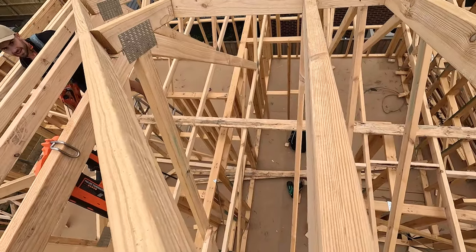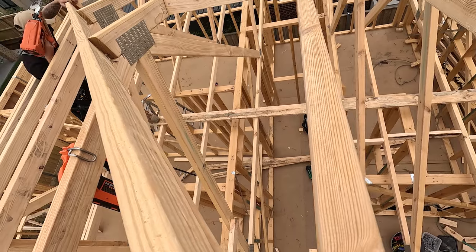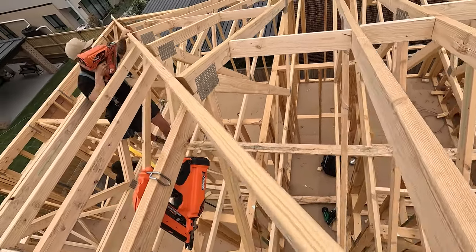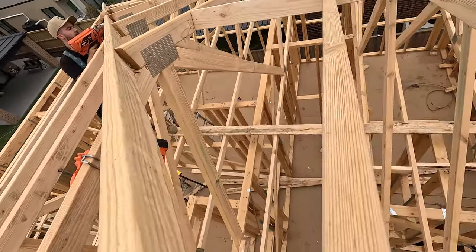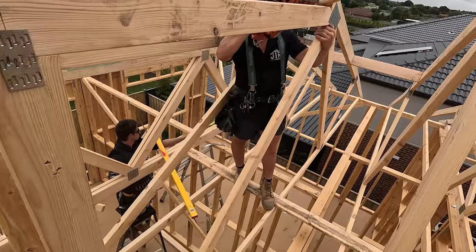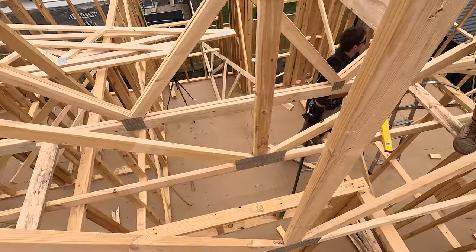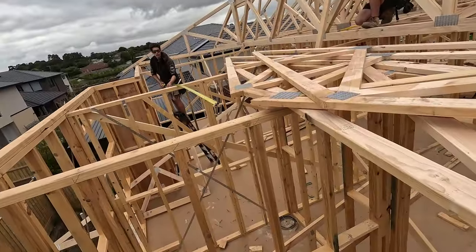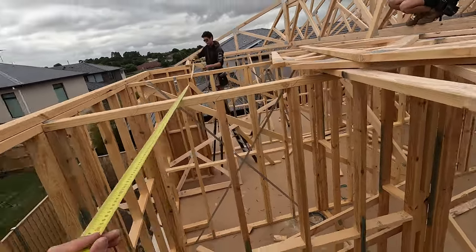Yeah, that's good if you want to shoot it into that truss that you're on right now. Yeah, that one there. And shoot it into the top chord too. Get at least three good nails. Beautiful. Let's keep the creepers for tomorrow and just get the hip ready on the other side. Brand new tape. There we go. Good work.